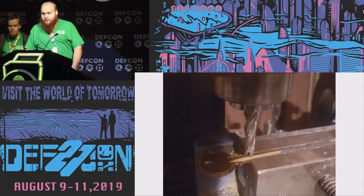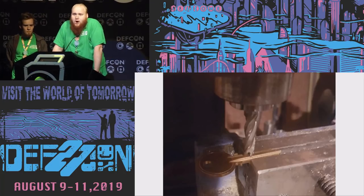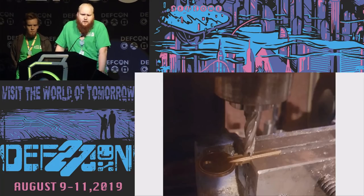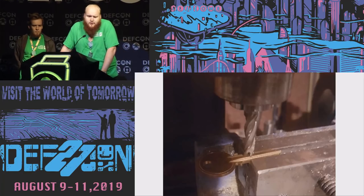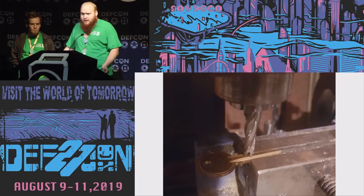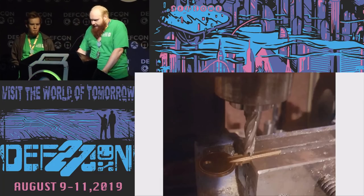You can also use an end mill. So this is a picture of modifying a Yale Y1 blank on a milling machine. This is a much more common piece of machinery than a keyway modifier, a horizontal mill, or a code cutter. So anyone that has access to hacker spaces, maker spaces, etc., you got $50 for a month, you can get access to one of these, and they can modify your keyway for you as well.